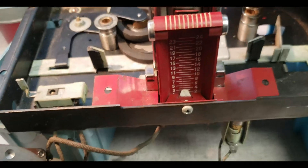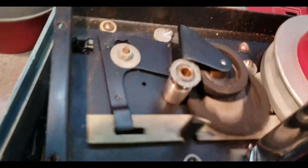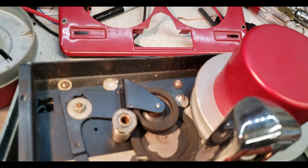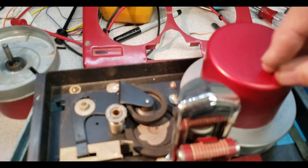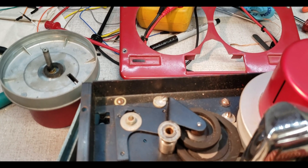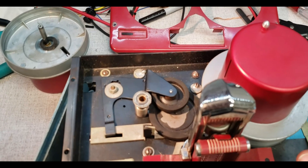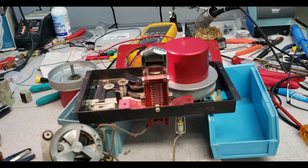Maybe it goes this way and then this rubs on the outside of this drum for forward. In the forward mode this gets pulled over here and rim-drives in this direction, and when it reaches the end that rubs on the inside of this drum for rewind. Auto-rewind! Oh, this thing just gets cooler and cooler.